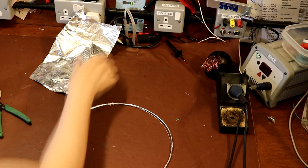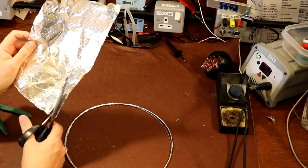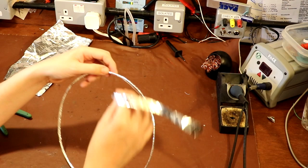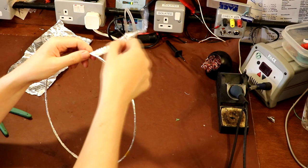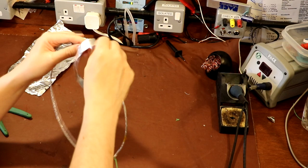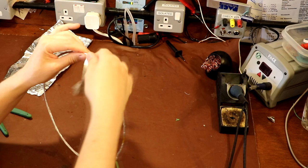Now, loop antennas can be quite useful as receiving antennas, because you tend to get a lot of localized noise in the environment. If you've got an antenna up at your house, equipment in your house gives off an awful lot of electrical interference. You tend to find, for whatever reason, that a lot of that interference will be electrical interference. So if you can build an antenna which is not sensitive to electrical fields, but is sensitive to magnetic fields, it'll often be a lot quieter in operation.